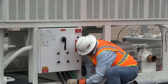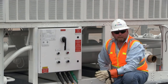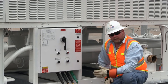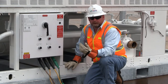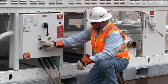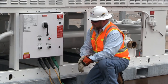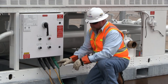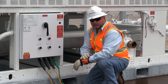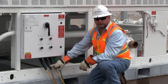I'm checking all my connections and cables. Note that this cable is not energized. Now that we have the power hooked up, we're going to remove our lockout tagout from our primary power supply and energize the machine to check rotation. We've energized our main power feed and turned the breaker on. Our power lights come on, but the phase incorrect light is on as well, indicating two of our phases are backwards — the machine is completely locked out. We'll kill the power, lock and tagout our main power source, then reverse two leads on the incoming power. Never change incoming leads on cam locks while they're energized; they must be completely de-energized. We've reversed L1 and L2 to get our phase correct.